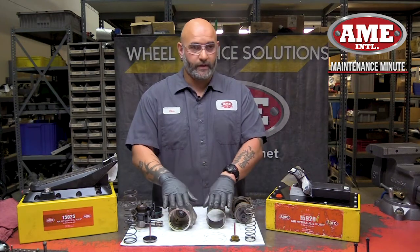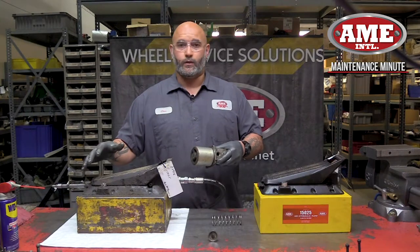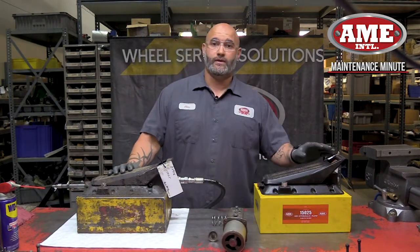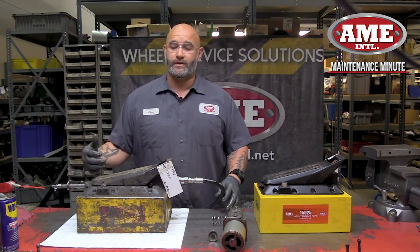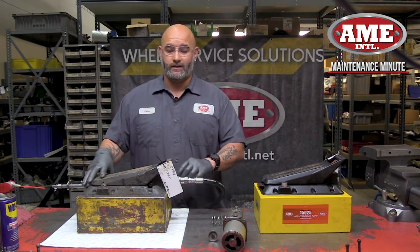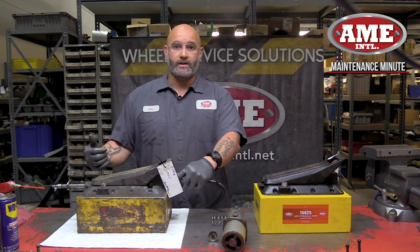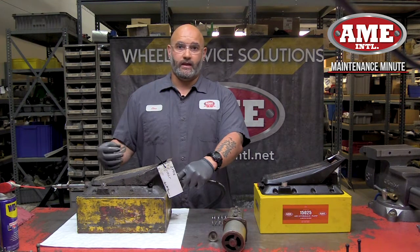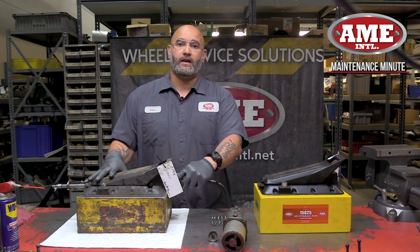Lubrication is key — one to two drops a day and you should be fine. It's a quick, fast tip. If you have air tool oil, please use that. The recommended amount is one to two drops for every eight hours of use. We generally recommend, especially when pumps are out in the field looking like this, once a day first thing in the morning give it a quick shot, get it lubricated, and pressurize the pump a little bit just to get that fluid moving back and forth within that air cylinder. You do that, you should not run into this kind of issue.